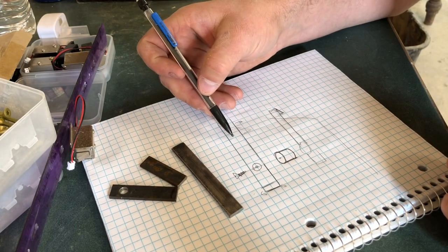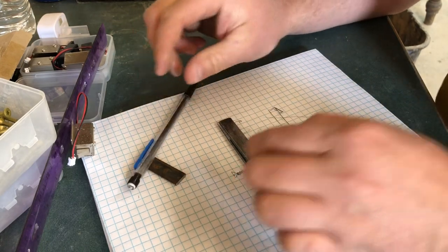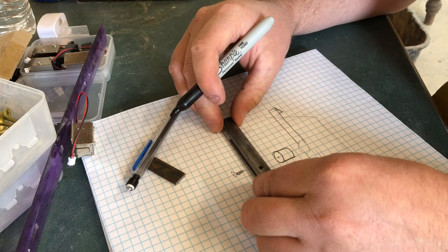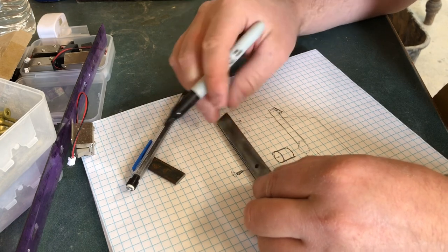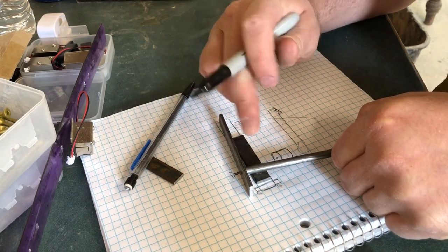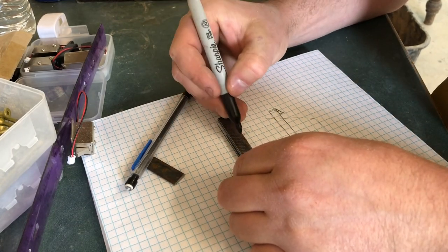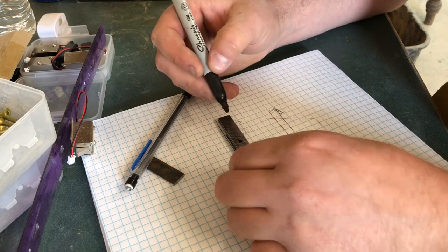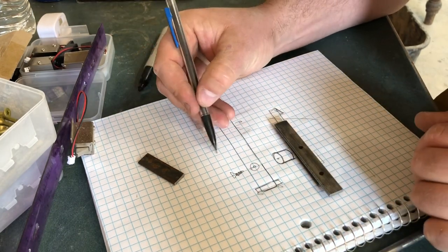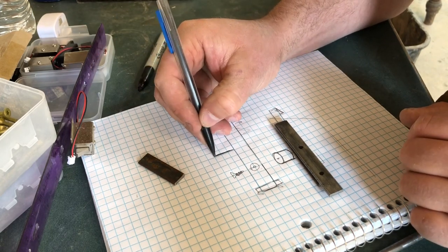I could make a pivot here, but I need it to go up when I push here. Drill a hole here. Weld on a piece of this bar sticking down and have that be the button where you push that up, and then do another one right here that comes the other way with a spring on it. Oh, that's how I'm gonna do it, and then it'll be a low profile. Might be a little bit more complicated, but I sort of like putting a puzzle together.